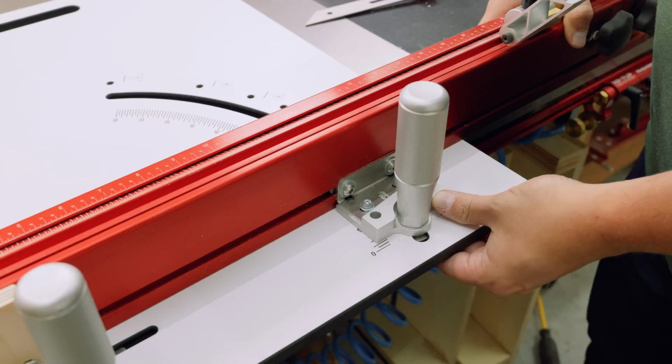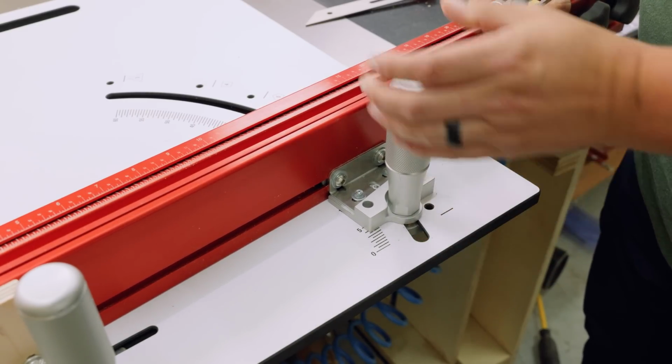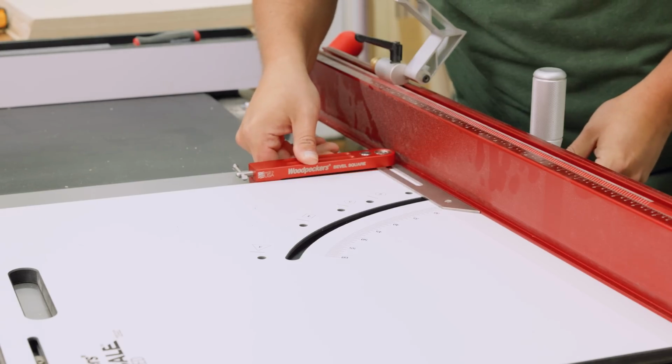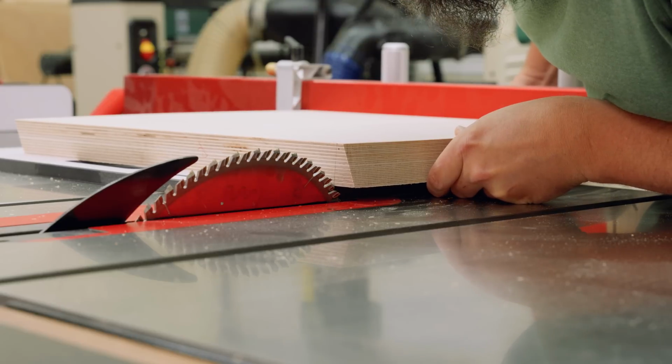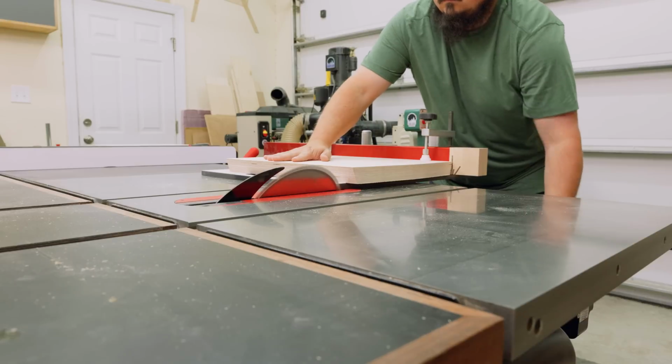From there, it was time to embark on probably the most difficult portion of this build, and that is the backrest. The first step was to go ahead and cut the bevels into the back of the seats, and since these are also angled bevels, they're technically compound miters. But I wanted to make sure that I designed the backrest so that it was comfortable to the sitter. Seated, you know what I mean.